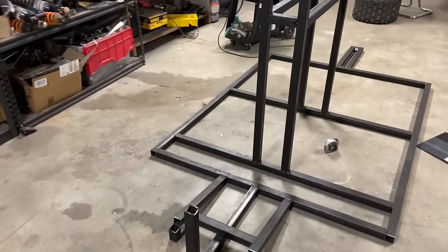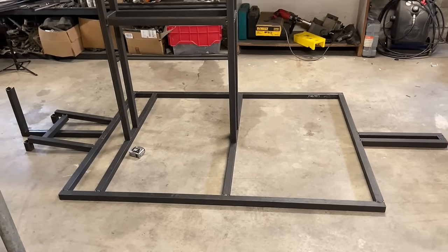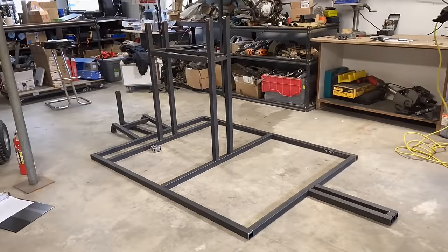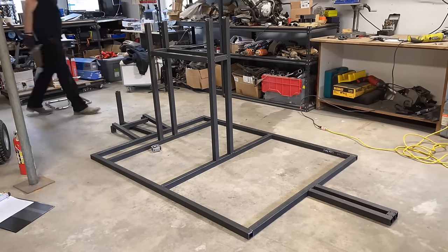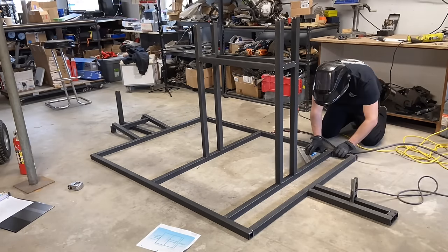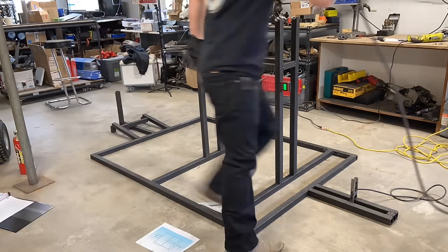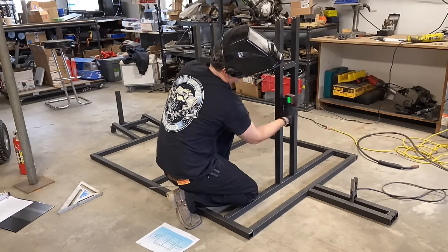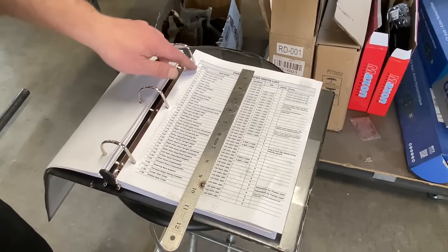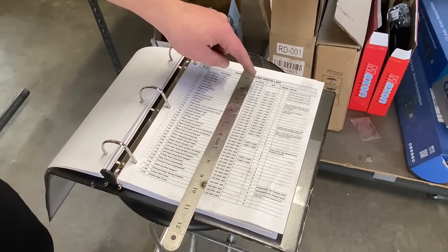A couple hours on a Friday night and now we have all weekend just to focus on the chassis. Day one. Let's get started on this chassis. Pay attention to the material used. C1 and C2 don't get bends. C3, C4, and C5 are all 0.083 — I'm using 0.095 because it's cheaper and more available.